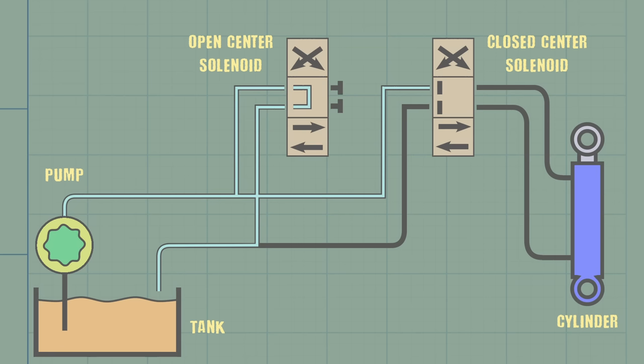Start with a bug, like this one, that makes it infinitely count to infinity. That's because it's still infinitely counting to infinity. Now the joystick doesn't work. Let's take it apart and restake these tiny copper rivets. It's possible there's a slight quality difference between the $700 industrial joystick and the $19 version that I bought. Oh well, it works now. No, it doesn't. Turns out integers aren't decimals, and the Arduino really hates floating point math. Yeah, they're not supposed to be flashing like that. Let's spend an entire day trying to fix that.